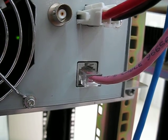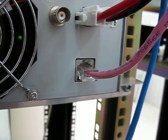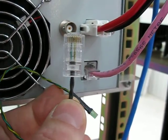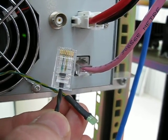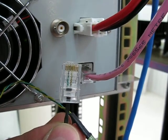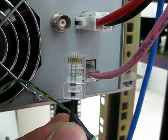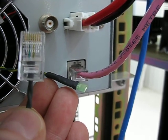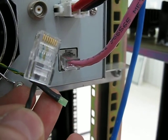I'm able to see this because I've got the N5EBW board fitted to my repeater, but not everyone has that. So I made up a very simple device, which is an RJ45, an LED and a resistor, and some wires, which can monitor the receive enable line. The ground wire is on pin 3, receive enable is on pin 5 — looking from my left, your left as well. I've just got a 33 ohm resistor in series with the LED. The output volts is around 3.3 volts, so that's about on the mark for the resistor.